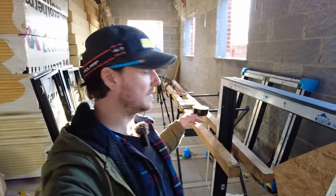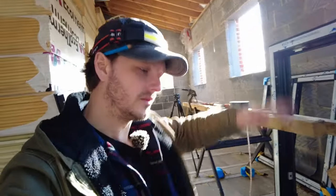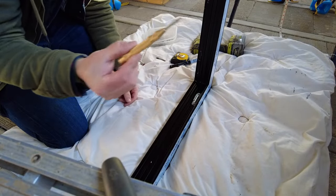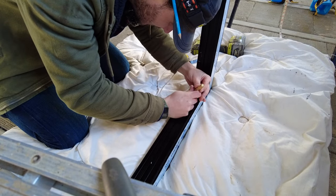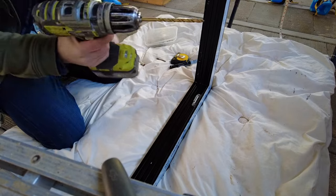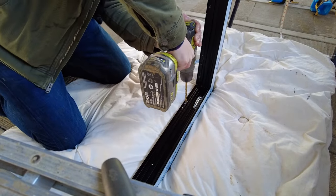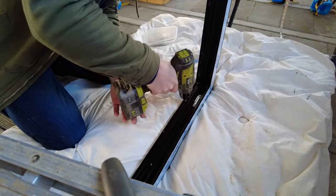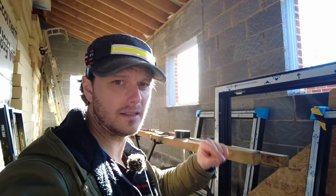I've set up a little jig or stand so I can hold the frame whilst I drill it — it's easier when you're on your own. We're going to drill and countersink it now. From the marking on the outside I'm going to use a spring-loaded automatic centre punch to get that in the centre — that makes it easier when you're drilling. Then I'm going all the way through with a 6mm bit for these particular screws because you want clearance, and then countersink it as well. I'll pre-drill all of them around the outside and then we can get cracking.